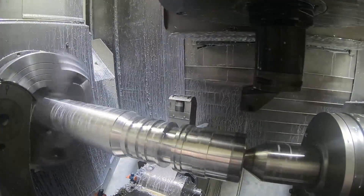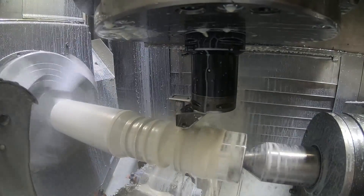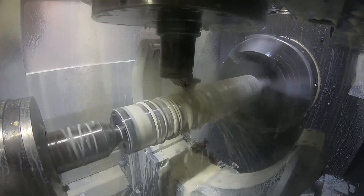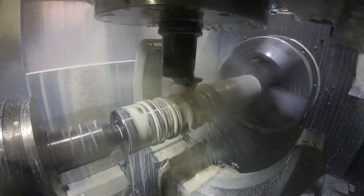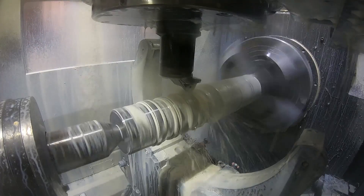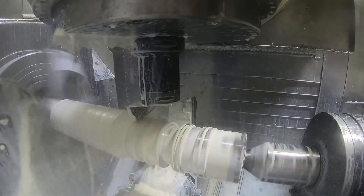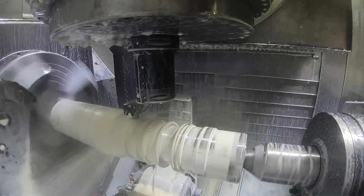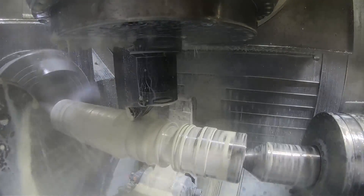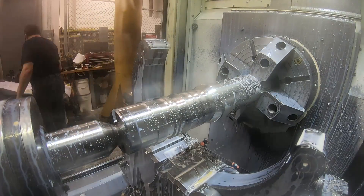I'm re-measuring the grooves to make sure they're the right diameters and trying to get the aluminum setup piece correct to dimensions. If you have some kind of numbers off in the program for some weird reason — although I'm programming from their CAD model so it should be close — you need to machine the setup piece to dimensions so you can see if something is off. This is the finished grooving tool, a Sandvik 156-thousandths wide grooving tool. Then checking the diameters of the grooves.